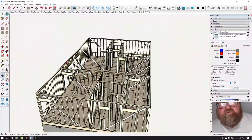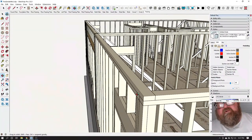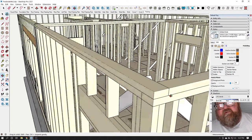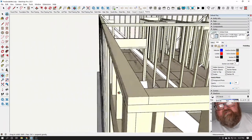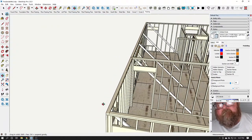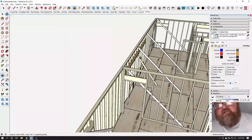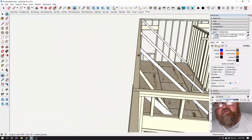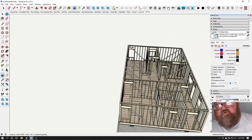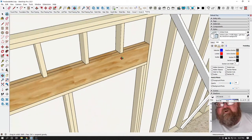Now we're at the point of straightening the walls. You're going to drive a little nail here and another on the other end, pull a string really tight from here to there, and leave it up off the wall about a half inch. You don't want it touching anywhere it's not supposed to. Then somebody sits up here and looks down — they say, pull this brace in, push it in or push it out. All of this wall should be parallel with the opposite wall when you start setting your trusses.